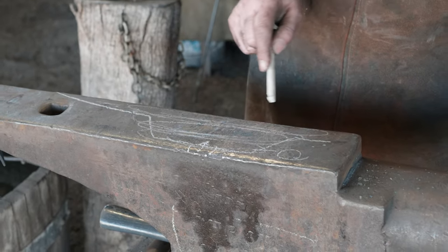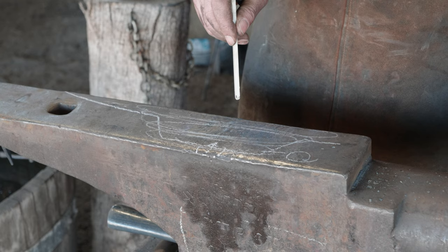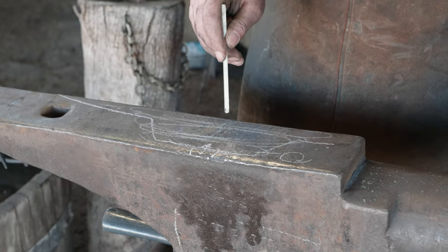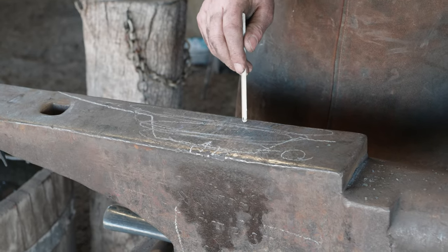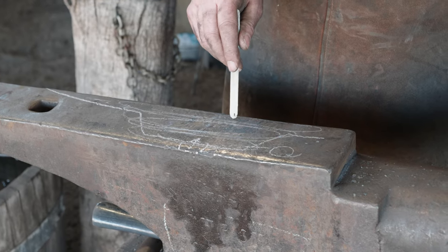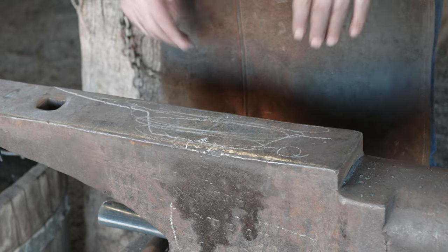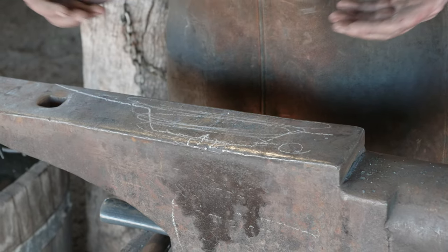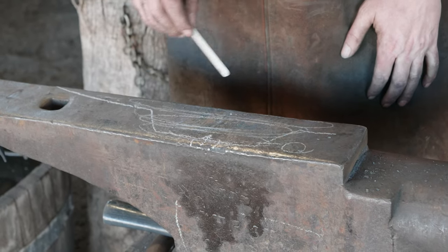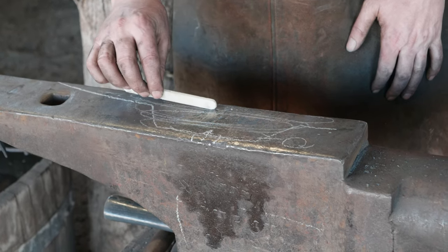Above that, you've got the reducing zone of the fire. This is an area where there is less oxygen than there is burning fuel — you are getting incomplete burning of that fuel and winding up with things like carbon monoxide. This zone can actually wind up with carbon migrating into your steel, typically in very small amounts, within this zone right here.